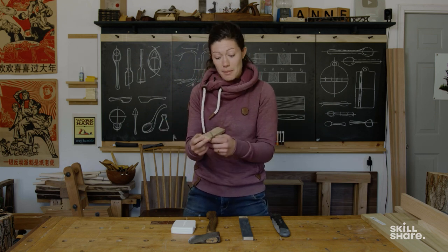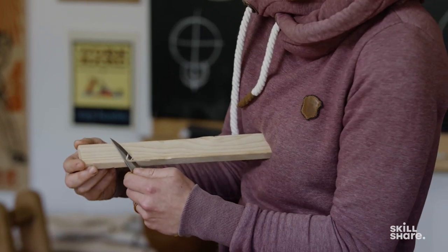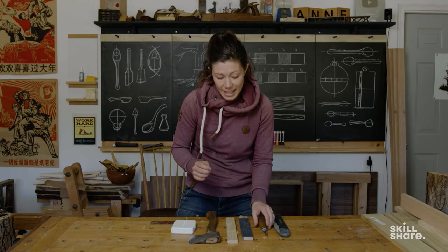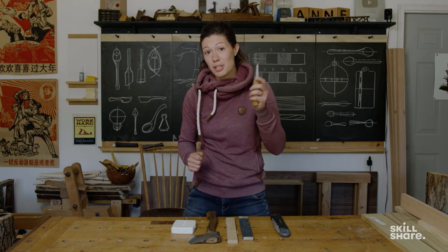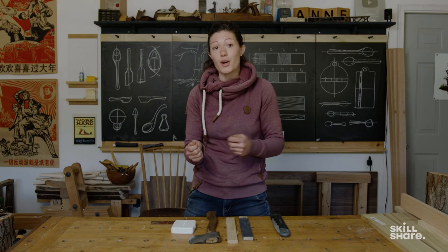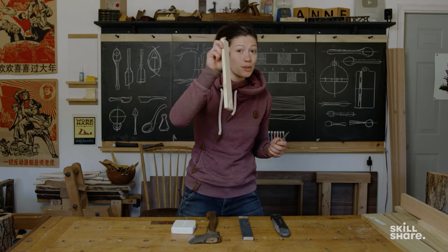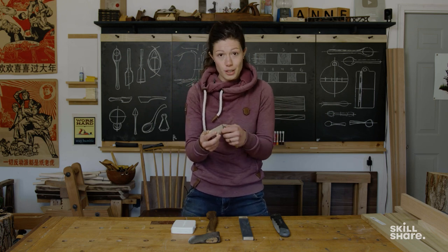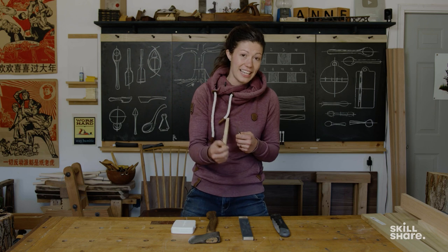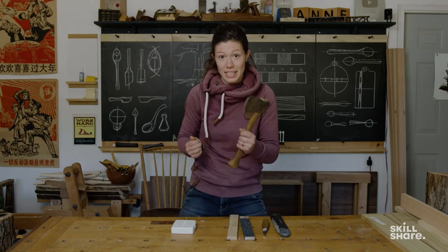What would happen if the wood suddenly disappeared? Because sometimes wood splits or acts differently than we think it should. So in this same cut, we are going to think about the wood disappearing — we are cutting right here at the hilt of the knife so that if that wood disappears, that knife can't slip down into these soft bits down here. Another thing that's going to help keep us safe is that our tool holding hand needs to act like a machine. We want to move it predictably, and then we are going to use our work holding hand to produce the wood to the cutting surface, not the other way around.